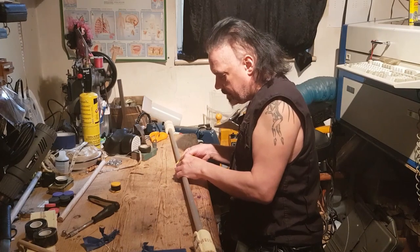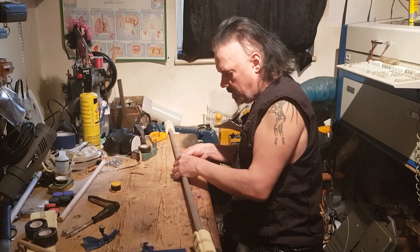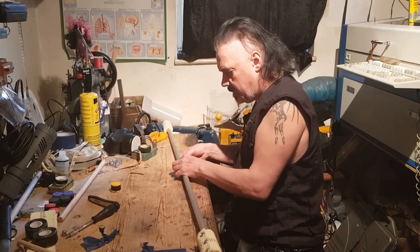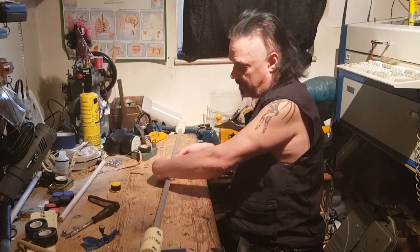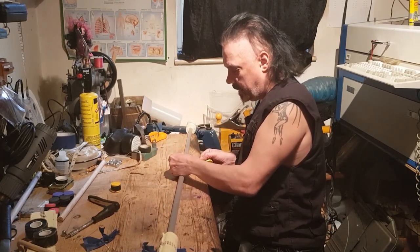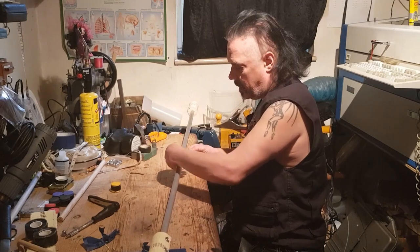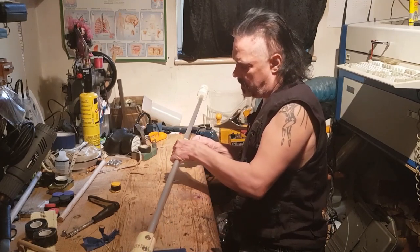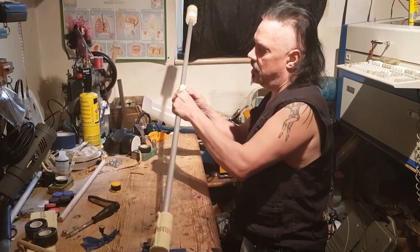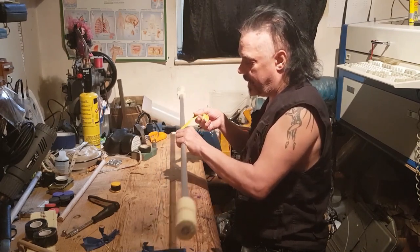I'm going to start, find my center line, then across my center line. I'm going to do it about 30 degrees. What I want is, when I roll it round, see, that's rubbish because it's not overlapping. I need it to overlap. So then down to about 15 degrees. And there I've got a little overlap. Sorry, my paws are in the way. And I want about a third of this width overlapping. And then I want to try and keep that as consistent as I can all the way along.